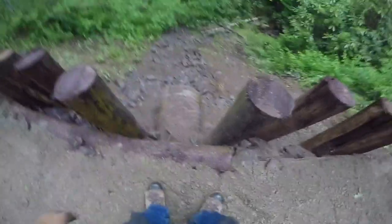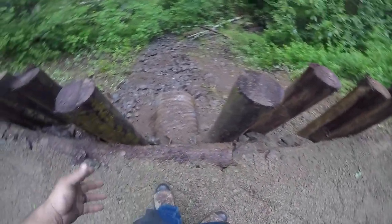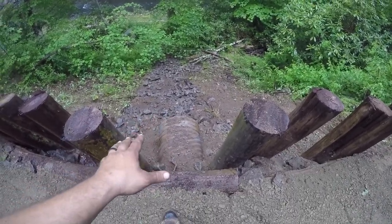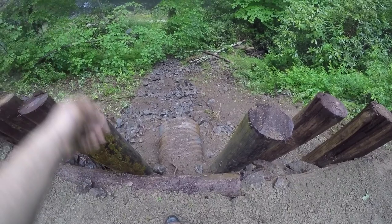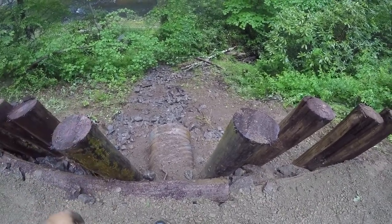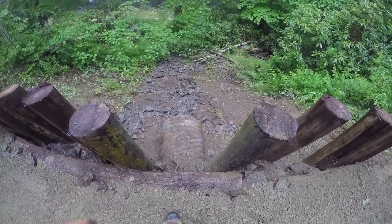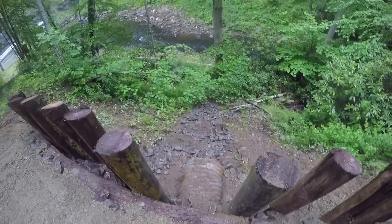These are spaced out more because the culvert's in between them. But anyway, we cut that locust log, and we put locust logs in there to help these smaller rocks not fall through. And then I put some riprap down there below the pipe. I wished I could have done a better job with the riprap below the pipe too, but the riprap that I had was so small, and that slope is so steep, it's just rolling. I tried to put some notches in the slope, but it didn't help. As soon as the rock would fill the notches up, it would just slide on down the slope. That slope is basically a 1-to-1, a 100% slope. It's almost straight up and down. It just will not sit there.